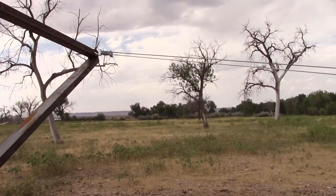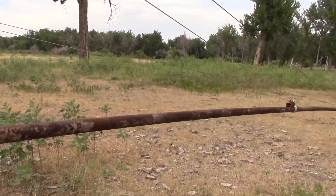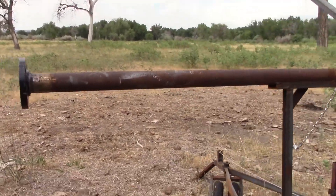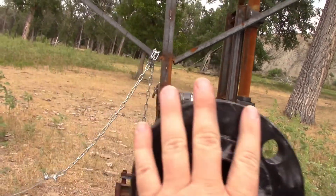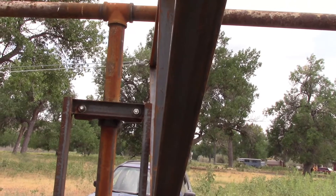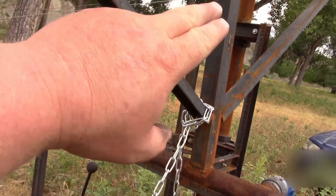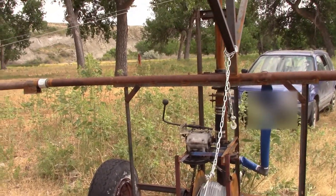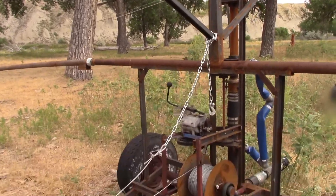Those pipe couplings were working good, but as you can see the eye bolt there — that's what started to bend when it was being forced through. But at least it gave me some good data here, so now I know what type of forces are being applied to this upper beam. Also check out how balanced this is right now with just one finger. When that one side did break it pulled everything over. Luckily this side was offset where it popped on that. So I will be adding some angular reinforcements down here to stop anything like that from happening and causing something more catastrophic. But this is early development and this is exactly how I usually troubleshoot to a final product — sometimes I build a lot of stuff in thinner material than I probably should, just to witness what failure points happen.